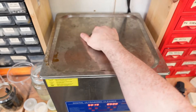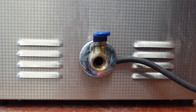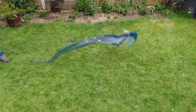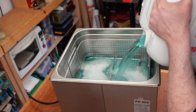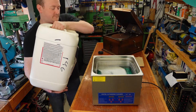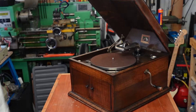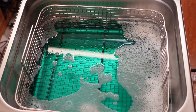Those of you following my channel will be aware that my tank was in a sorry state and definitely needed cleaning out. These tanks are quite well designed — there's a little valve just to dump all the old stuff out. You should bottle it up, label it, and take it to your local chemical disposal center. Once the tank's been cleaned out and dried, it's the pleasurable part of refilling it. Just pour some in — somewhere between one quarter and three quarters full. It's not worth putting more in than you need because it just gets dirty and you have to throw more away. It's not cheap — look at that beautiful blue pristine little ocean there, ready to wash more circuit boards.